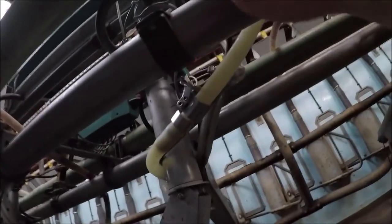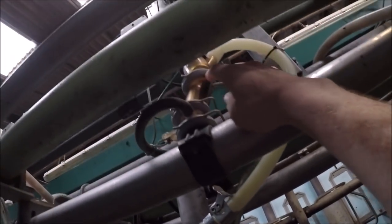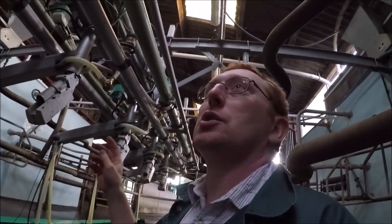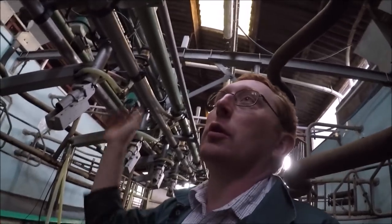I've never measured the temperature within the parlour, but when outside is about -3, that's when the flushing system freezes up. So down to -3, we've got no issues at all. The flushing system will catch at -3. When it gets to about -6 or -7, the diaphragms in the shutoffs up on the milk line sometimes will catch, but all you need is a jug of warm water and they're going.